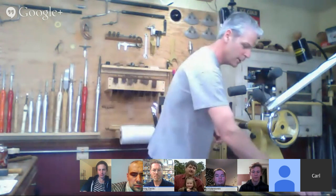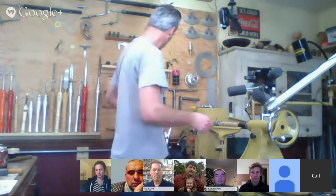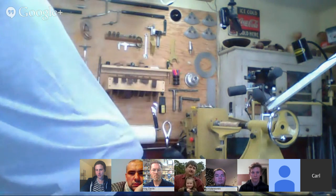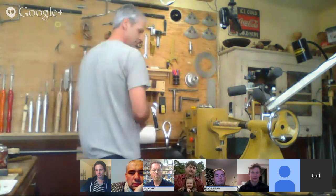All right. So what I'm going to do here is bring down this part right here to fit the ferrule. So come in, and then I'm going to use a parting tool for that. I'm just going to bring that down to diameter. And so with the parting tool, I'll come back over.